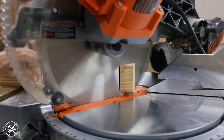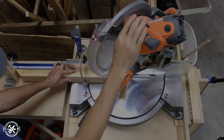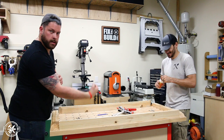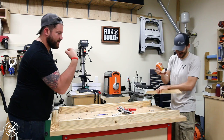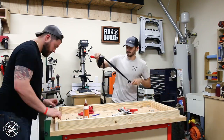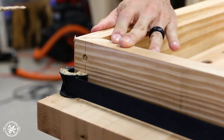Using a wooden spacer block next to my metal miter stop helped keep the pointed end from the miter from creeping behind it, and using a clamp to hold the workpiece to the fence makes for a much smoother miter cut. After John was done with an impromptu gun show, we glued up the frame. We used a band clamp to hold everything together tightly and after making sure the assembly was square, we secured each corner with countersunk two-and-a-half-inch screws.